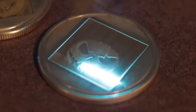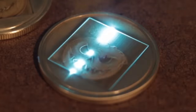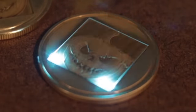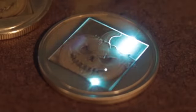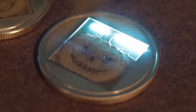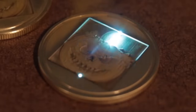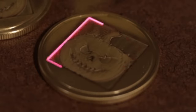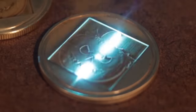Essentially, what you'll see is the layers are going to be laid down over existing layers. Now that in itself isn't a bad thing, it all depends on the artwork you're using. But what can make an enormous difference is the level of detail. As we get deeper, you'll notice that the layers are far more jagged in this case. This is an issue of forcing two levels of gray into a single layer, which is effectively less detail and will cause much larger stair step effects. This will occur on its own, but it's being blown up by running the engrave twice.